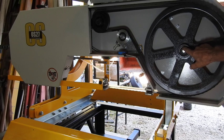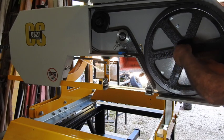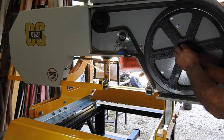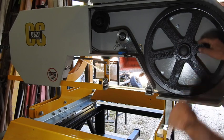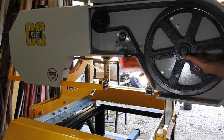And it looks like it's fairly easily replaceable because you know there's only so many hours of operation on a permanently greased bearing and it's going to have to be replaced. Whereas a greasable bearing, I think, has a greater life expectancy, but you have to maintain a regimen of continual grease to make those bearings last.